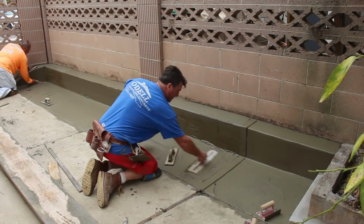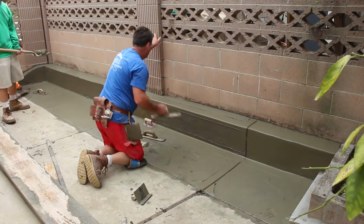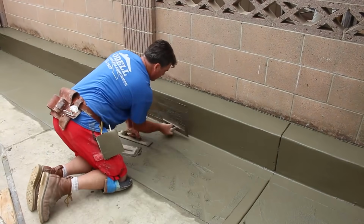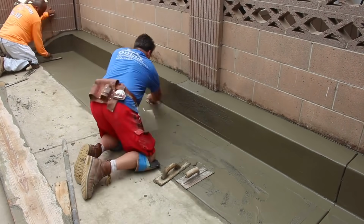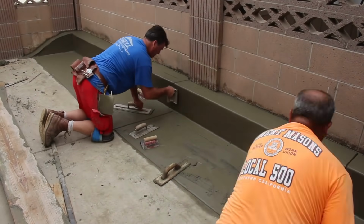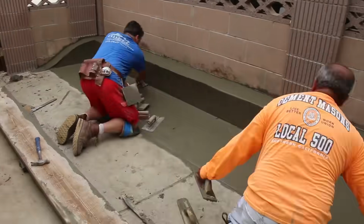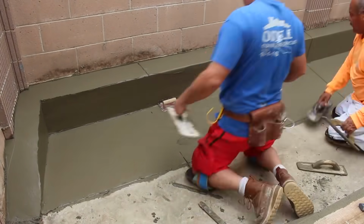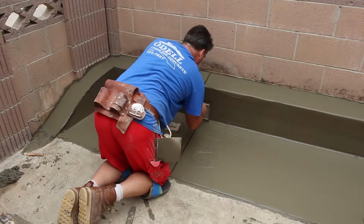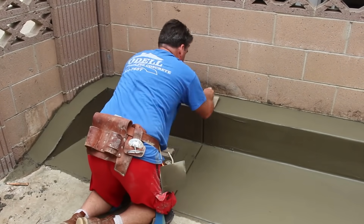just for fun. I'll run a 1/2-inch cove at the bottom, and then I'll run the 1/2-inch top tool. And there's not much left in the middle when you do all that. Depending on the size coves you're using, you can almost catch this whole curve from the top and bottom. I got some minis on me, but that leaves me about a 4-inch space in the middle that I'll have to hand trowel after I run my top and bottom tool on that curb face.